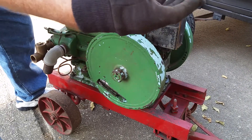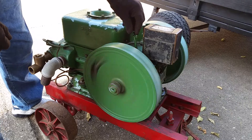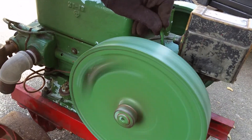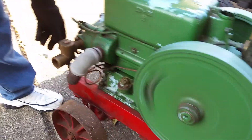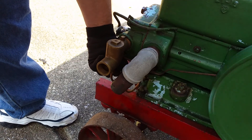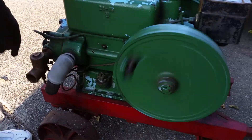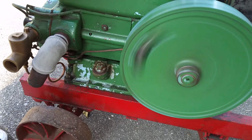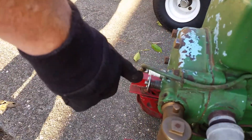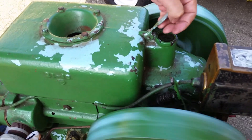I'm going to give it a spin — I'm going to wear gloves, otherwise you'll end up getting blisters like I did. See how I move that lever a little bit forward, and then you open it up pretty much all the way. Then the idle mixture control — find the spot where it runs about the best, which right now is about two thirds. But as it warms up you may have to adjust a little bit. That's how you start it. You notice the intake valve sawing in and out — that's normal. You're going to see the top of it kind of rattled around.